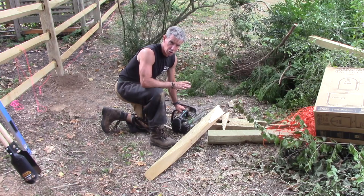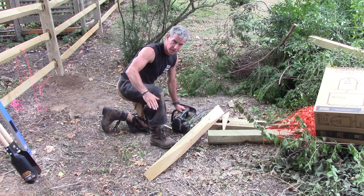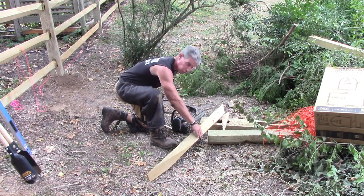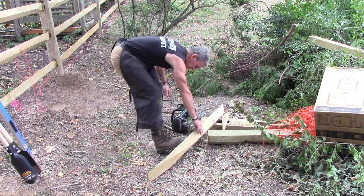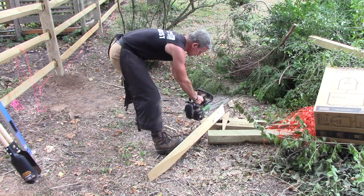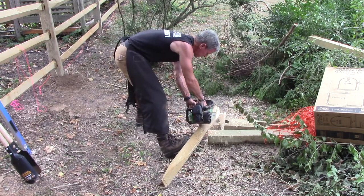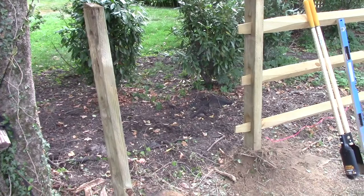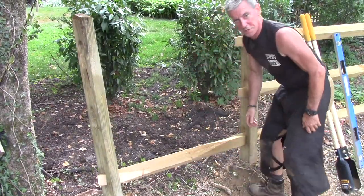Almost for sure, you're going to have a short section where you're going to need a modifier rail. The way the angle on a split rail fence works is like this: the mitre is taken off the rail when it's positioned with the corner up. I've got this one started already. And that should fit right here in my shorty section — like it's supposed to!